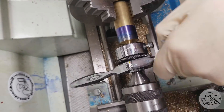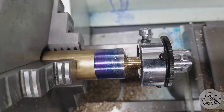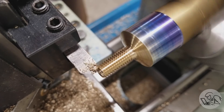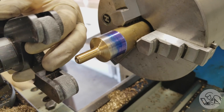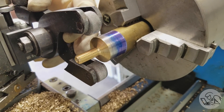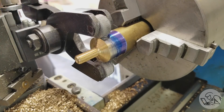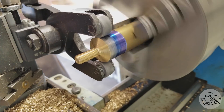People always ask about this ratcheting tap wrench — there's a link down below if you want to buy one. I use it because it holds hex dies and my metric dies happen to be hex dies. With that thread cut, we go back in and chamfer it again because the thread die chewed up our chamfer on the end. Now we're going to knurl the knob itself — I bring in the scissor-type knurling tool, lots of cutting fluid, and I snug up the wheels before starting the machine so that the wheels find their timing.